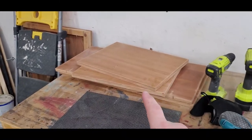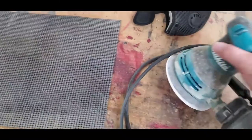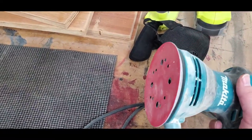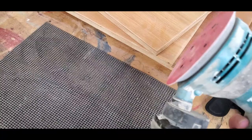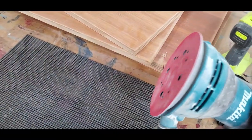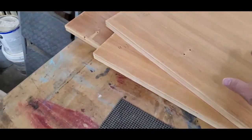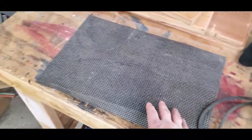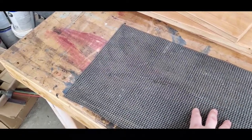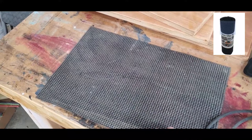I did have about eight doors that were too wide for the planer, so with those I had to get out the old orbital sander. For this I used a 100 grit sandpaper disc, which worked out pretty well — I wanted to use 80 but I didn't have any. I used some shelf liner when I do my sanding so it doesn't want to vibrate or slide around too much. Very useful — I'll put a link in the description if you want some.